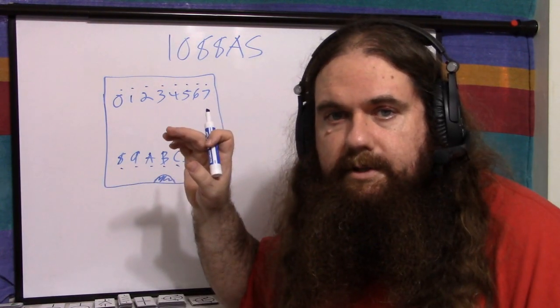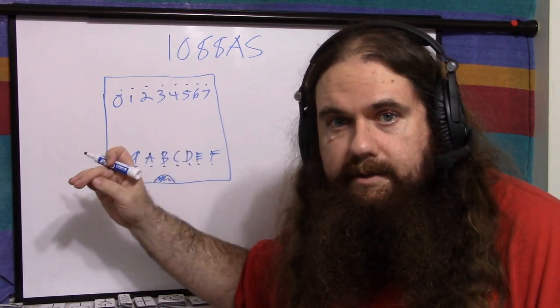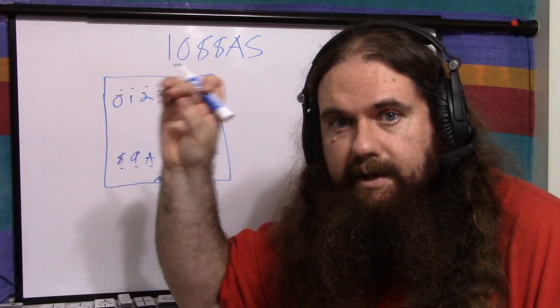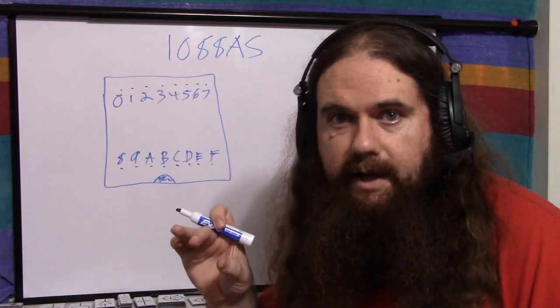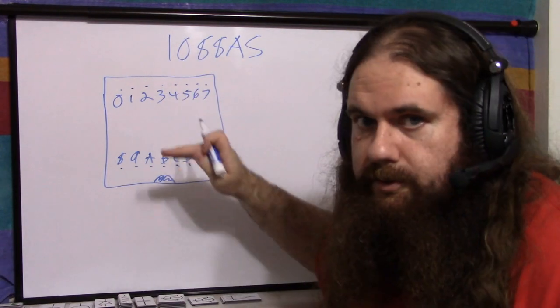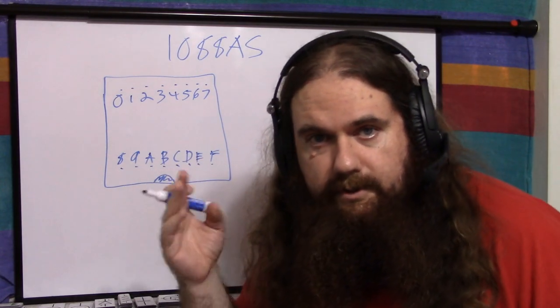So what you can do is apply power to one row pin and 0 through 8 column pins. So you apply power to one row, and then however many of the columns in that row, or the other way, whichever you want. So you could do 1, 2, 3, 4, 5, 6, 7, 8 separately. And then you do it fast enough because you trick the human eye.